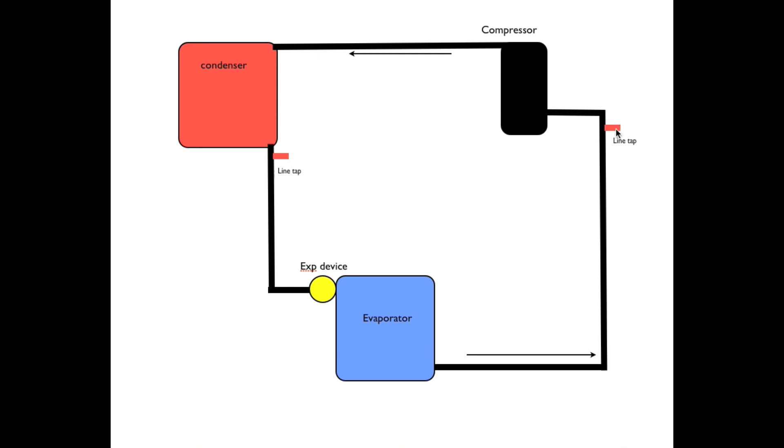I take my first evacuation, open up both gauges as far as they'll go, and get the best evacuation I can. When I finish that, I will add refrigerant on the low side. I don't put nitrogen in — I don't think it's the right thing to do. I don't want to put a non-condensable gas in the system between evacuations because I think that's counterproductive.